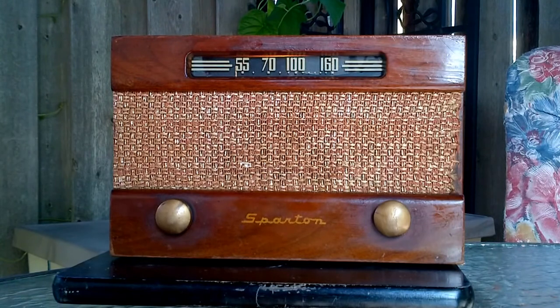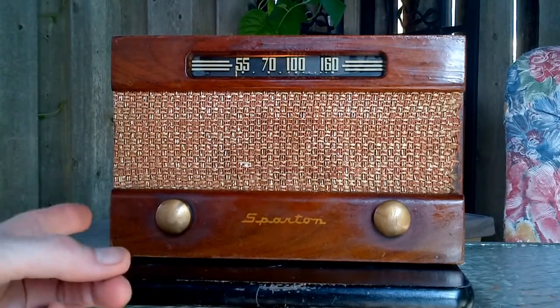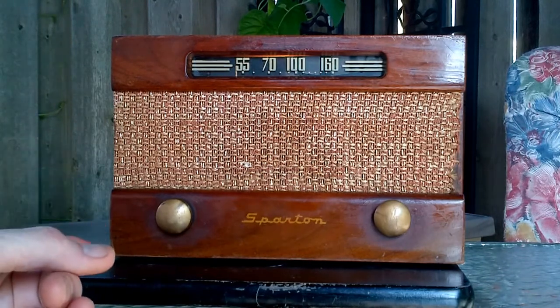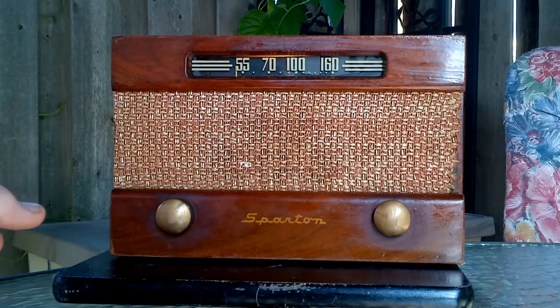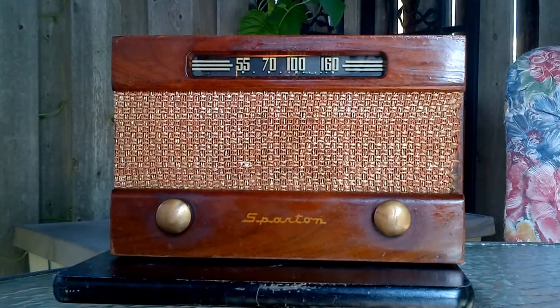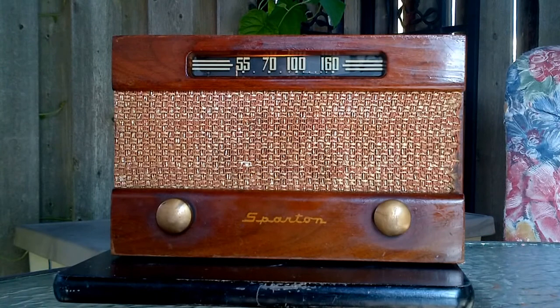So there we are. I think the radio stands up really well now. Before reconnecting the antenna and touching up the IF adjustment, this radio was receiving terribly. So now it's really working good. So I think that's all it takes. Get the antenna connected right. A little bit of internal tuning and bingo.